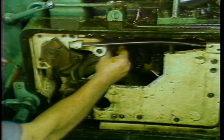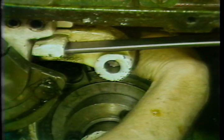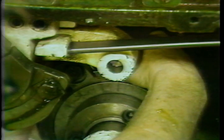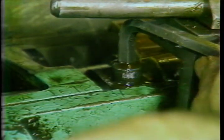Once the correct dimension is reached, you can mount the return cam. Stop the machine immediately after the die head opens. You can now mount the thread return cam on the cam plate and position the cam to cause the threading spindle to clear the part before index. With the cam roller at the high point of the return cam, you can adjust the other trip collar. Slide the other trip collar back against the spindle mounting bracket. Start the machine and check the die head after index.